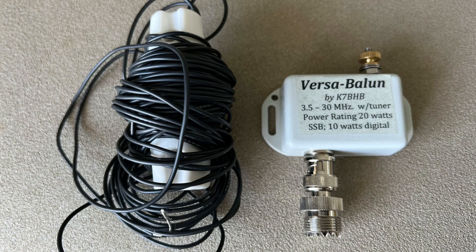I'm going to play a little radio and I'm going to put together an antenna. It's basically a random wire antenna. What I'm going to use is called the Versa Balun. I've used this thing before in the harbor at home with just 29 foot of wire in a vertical — it did okay — but this thing was designed for a 37 foot piece of wire. So it's a non-resonant random length of wire. I'm going to put it together and hang it over this balcony and see if we have some multi-band radio action here.